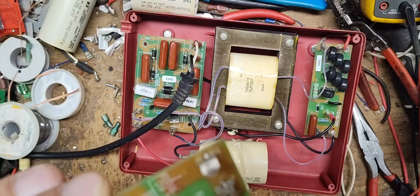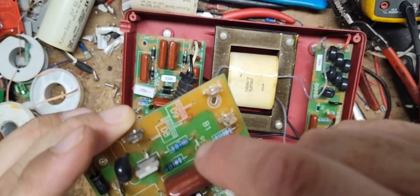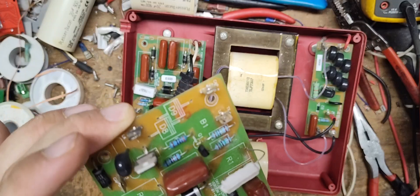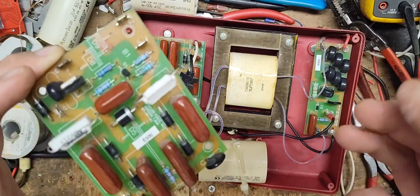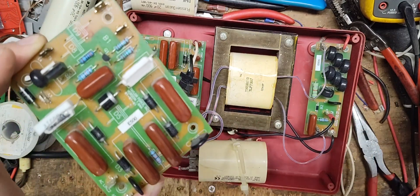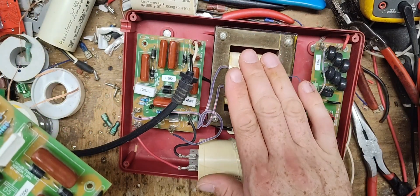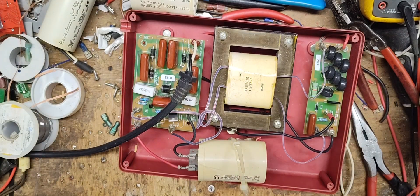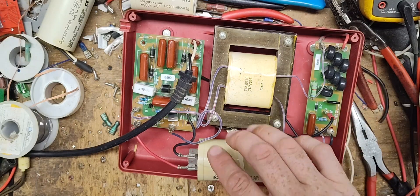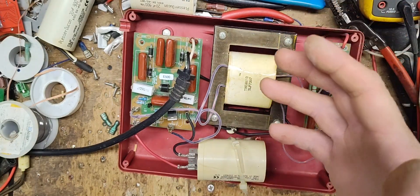That timing component triggers the big SCR to fire - this combination of components tells this when to fire. It has to build up through the multiplier circuit, which changes the AC voltage over to a DC voltage. All fence boxes - whether solar, plug-in, or battery - by the time they discharge that energy, all of it has been converted to DC voltage and current. The voltage on the capacitor is anywhere from 600 to 900 volts DC, at high amperage, and it dumps that into the transformer.